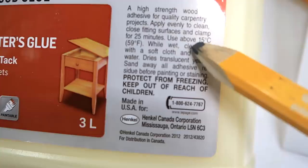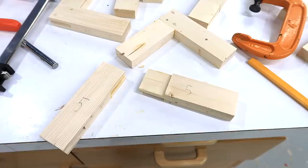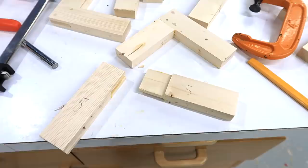I'm thinking maybe it was too cold when I glued them. It was 13 degrees Celsius down in the basement — about 55 degrees Fahrenheit. Looking at the glue I used, it says to use above 15°C or 59°F. I always thought that as long as the glue doesn't end up looking chalky, it'd be okay, but I might be wrong. If the failure is all in the glue, then reinforcing dowels like this will actually help.